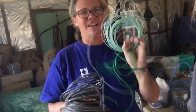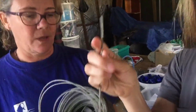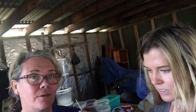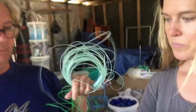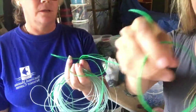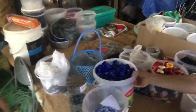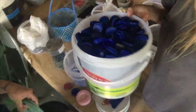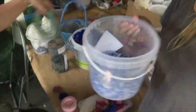Stay tuned for all the experiments and new uses for plastics. Positive vibes, guys — we've got solutions coming. All is not lost. Have hope! Here's some filament — these are made out of bottle caps, complete with labels, that's why it went a bit grey. The cleaner stuff — using bottle caps without labels — gives really bright colors. Over here you can see we've separated all the bottle caps into their different colors, so you can get a nice clean blue filament. I also mix them with milk bottles, which is HDPE as well.